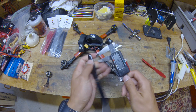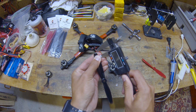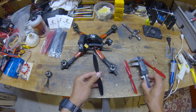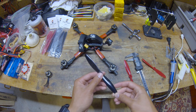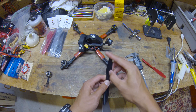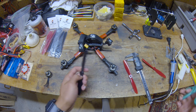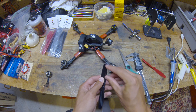I'll do that to the other side. The reason you want to do this instead of just completely eyeballing it is to maintain consistency, because you want consistent props on all four motors and a balanced prop as well, since we are going to be removing material from this prop.